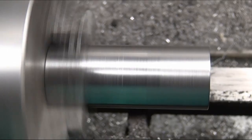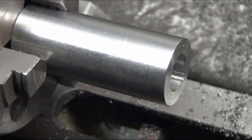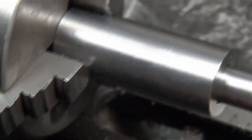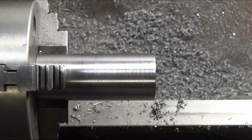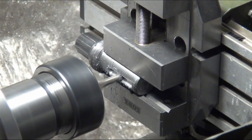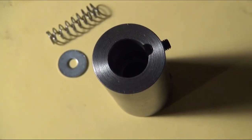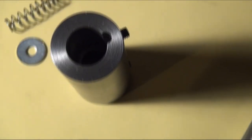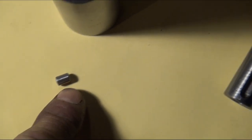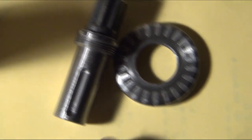The body of the coupling was drilled with a keyway off-center, then drilled and bored to fit the spindle at one end and the shaft at the other end. I cut a keyway in the coupling spindle. Here is the body of the coupling with a spring to push the spindle forward, the keyway and key trapping bolt, the little key that drives the whole machine, the keyed spindle, and its handle.